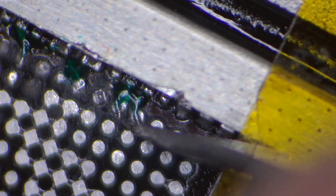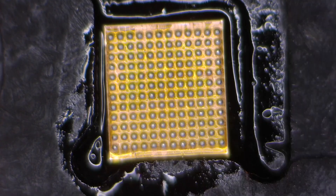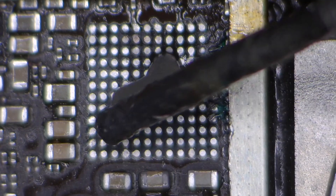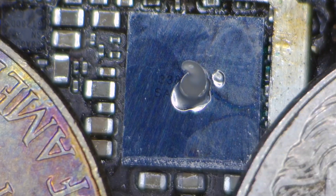For the finishing touches, we'll snip this down a bit more and scrape away any excess UV mask. Then we'll clean this up and slide on over to reflow the balls on the bottom of the audio chip. We'll make sure it's nice and clean, slap down some flux, place the chip down and add a little more flux as a cherry on top. Then we'll grab our coins, our heat gun, and melt everything back into place.